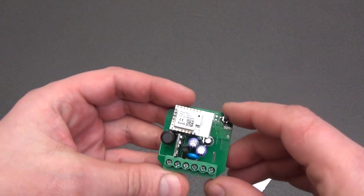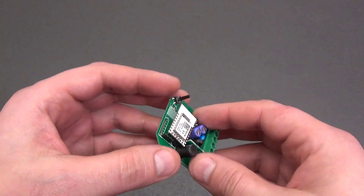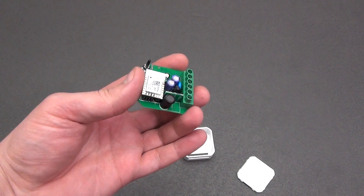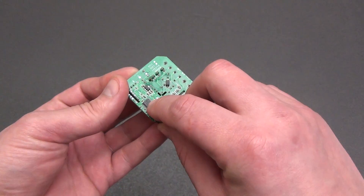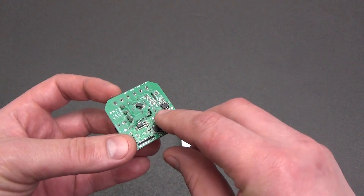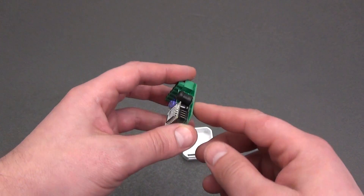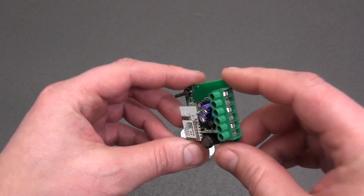Unclipping the back cover, we see the ZS3L module soldered on a separate board, which is responsible for the brains of the device. The ZS3L features a 32-bit low-power ARM Cortex-M33 core, 768 kilobytes flash and 64 kilobytes RAM, and rich peripherals. On the back of the board there is an STC8G1K17 microcontroller by STC. The BL0942 chip is responsible for measuring electricity parameters. Data sheets for these components are available online. Importantly, this is not a relay but a measuring device — we only measure parameters and cannot control the connected load.